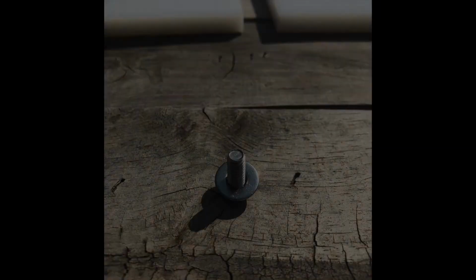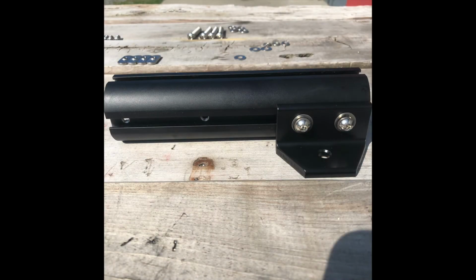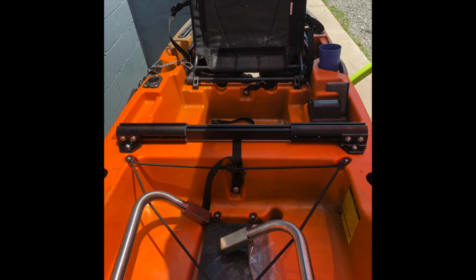Using the track nuts, flat washer, lock washer, and 1/4 button head cap screw, fasten the gussets into the knuckles. Arrange the knuckles where the set screws will be at the rear once you lay the assembly flat into position. Insert the crossbar and tighten the outermost set screw on one side about 1/2 inch from the crossbar. This will end up being the final position on that side, and you'll only have to make one cut on the crossbar later on.